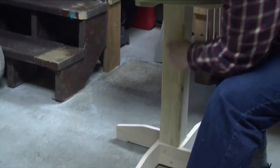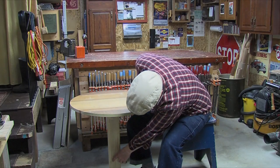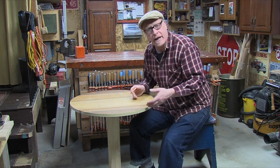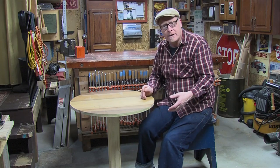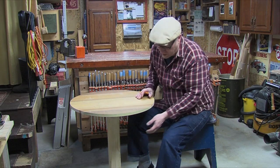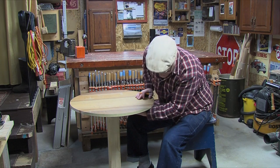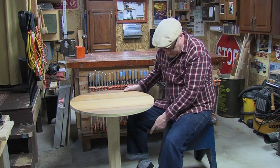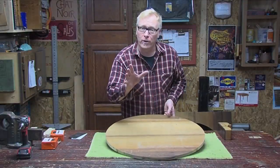And again, you can also sculpt out, take this to the bandsaw or use a hand coping saw and cut away the middle to soften that and lighten it up. There's a lot of possibilities. You can turn this, you can even buy pre-turned pedestals you'll see for handrails and things like that at your home center. If you wanted to use that, keep the end square and do the same joinery to fix the feet and the supports. All right, that looks great.